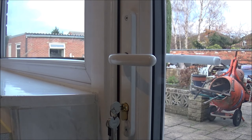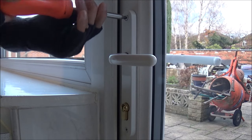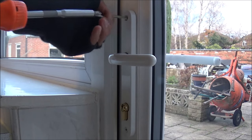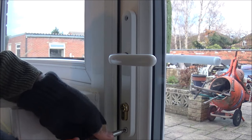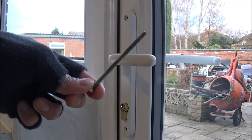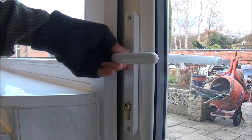Okay, the first thing to do - just get a Phillips screwdriver. Take the key out for the moment. Undo both these Phillips screws with the handle. They're quite long screws - they go straight from there to the other handle. Okay, top one, bottom one. So you can move that out. Don't just pull out the handle yet. Just open the door. Make sure the door is open like that, and make sure you leave the door open. Then now you can pull the handle out.